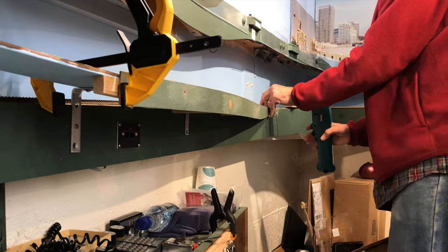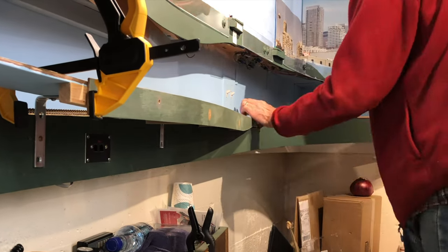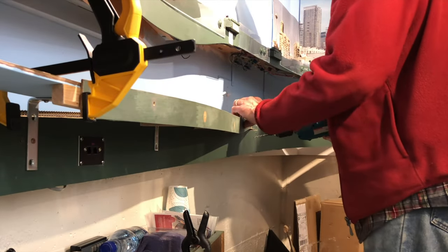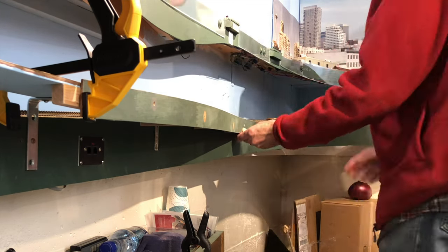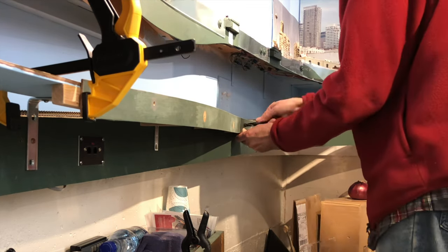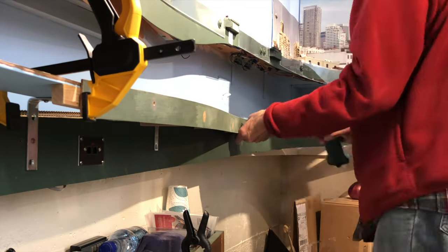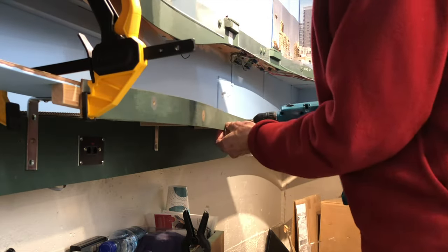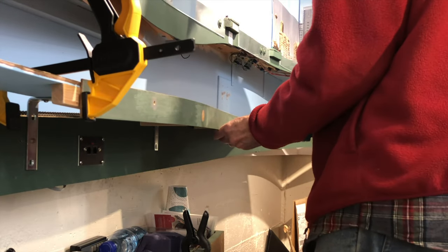That's what happened here. So now you can see that I've installed some boards underneath my quarter-inch plywood to hold the screws to support the front fascia. And basically the drill, no pun intended, is to put a hole in the wood that you want to screw into, and then using a large drill, you make a countersink in the fascia. And you'll see this in a second.